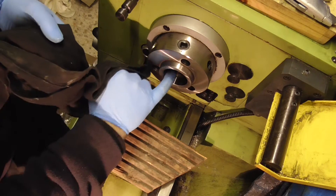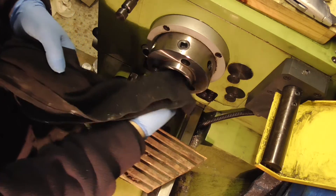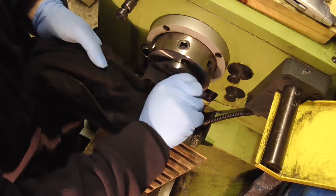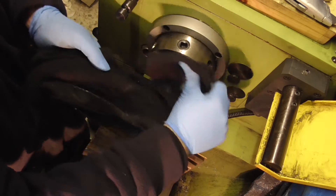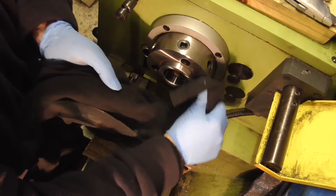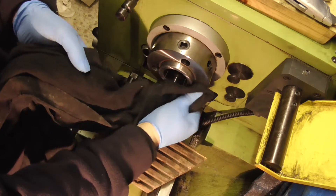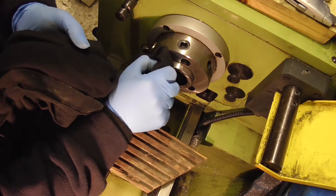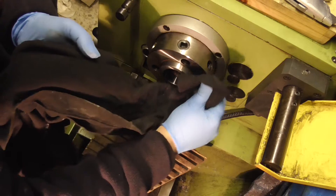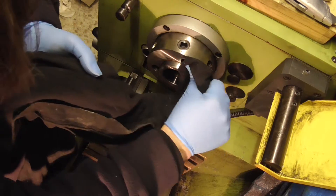The Walco's have a Morse taper as well — I believe it's a number five. With the lathe there is an adapter from Morse 5 to Morse 3, which the tailstock uses. The tailstock is a number three, or at least it is on my lathe.